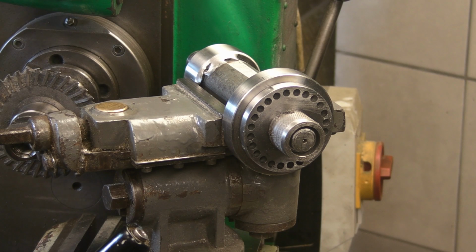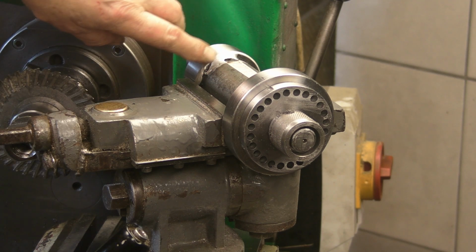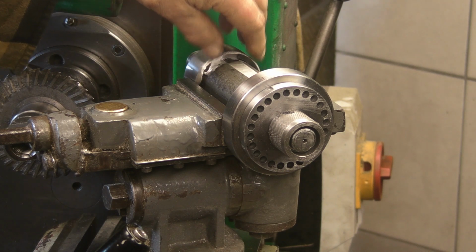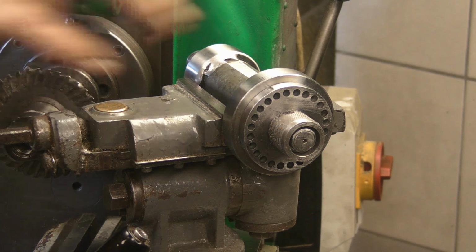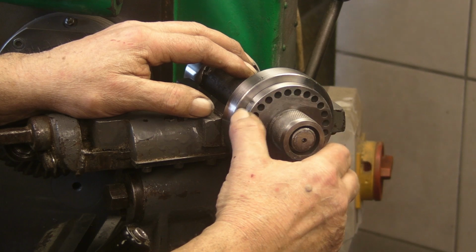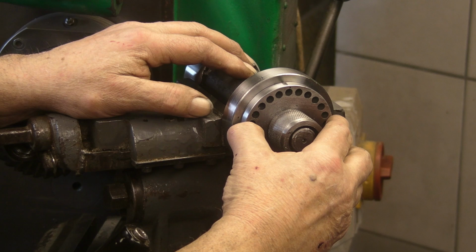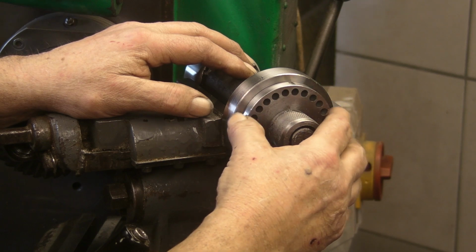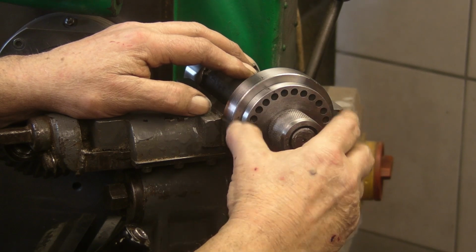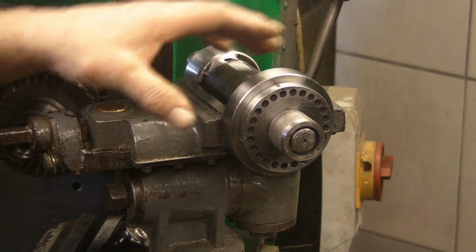Well, I think we're there with the tool cutter grinder, guys. I managed to take that sharp corner off with the angle grinder with a flat disc, so that feels a lot better now. I've put the four indexing marks at 90 degrees, so I don't have to count the holes now. I can just go off the mark. So whether it's 2 flute at 180 or 4 flute at 90 degrees, I've got those marked off.